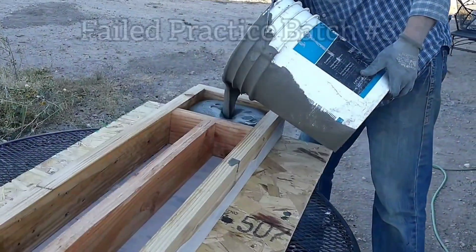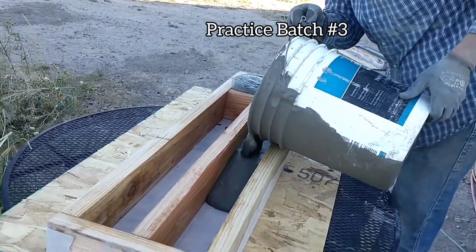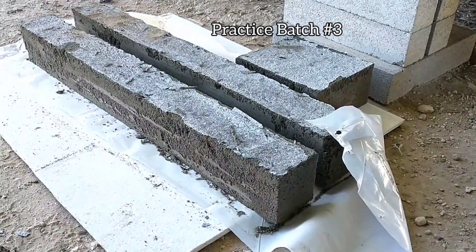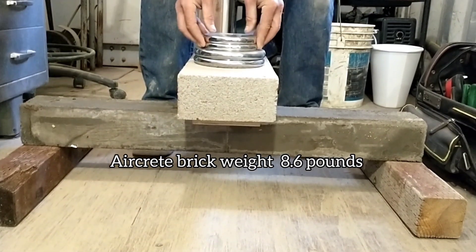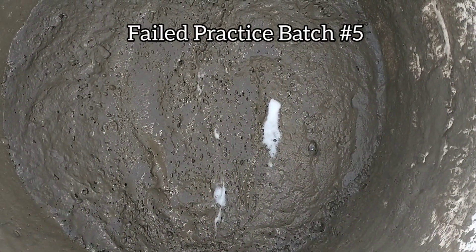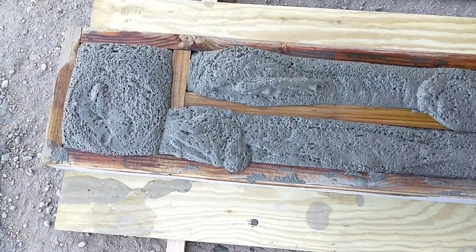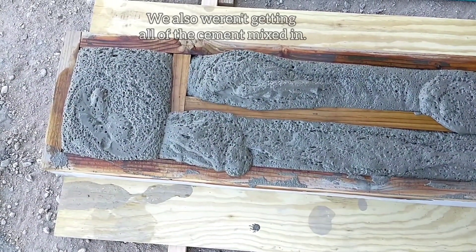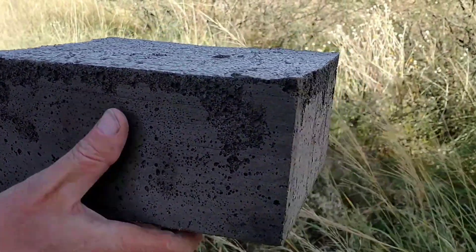Here we give a recap of all the test samples so you can see the texture, what they looked like as we were mixing and pouring them, and how they performed on the tensile strength test. The first two batches were basically just practice mixes. We did have the softened water hooked up for these, but the problem was our foam mix was off — the regulator was drifting and shortly into the batch it got way too dense. We didn't realize that was happening and so we got some funny mixtures.